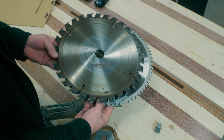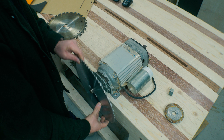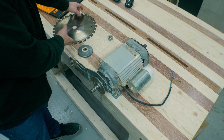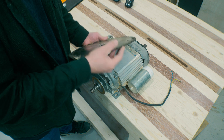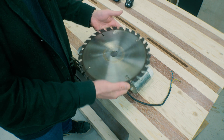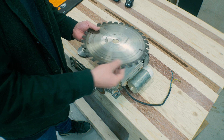This is the old blade. So the blade goes on here like so. The riving knife has to be thinner than the outer width of the saw blade. That's why I am going to use this old blade to make the riving knife — at least that's my plan. Because this is 2.2 millimeters thick and the outer saw blade is 3.2 millimeters, so that will be a perfect fit.